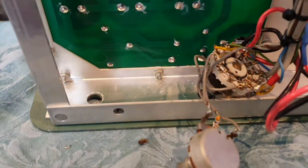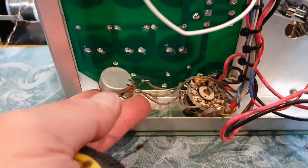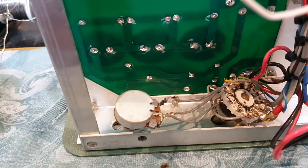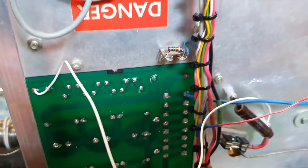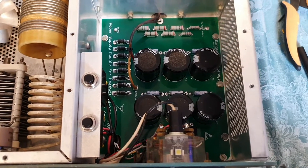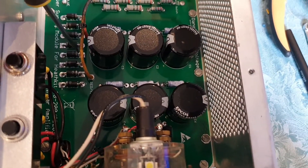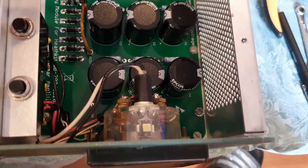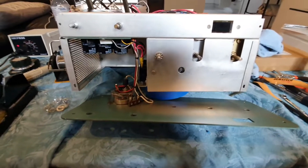Making it neat, putting all the screws back in, and going to start to screw the board down. In order to get to the reinstallation of these final nuts - one here, one here, and one just over here - you need to carefully remove the potentiometers and then start reassembling back. I've got to resolder the HV line into here - that's next. Power supply board is in, all the screws are snugged down. Did the final installation of the transformer wires coming into the board and neatened up all the other areas.